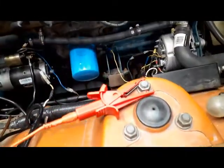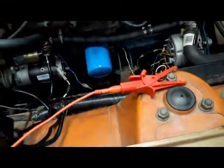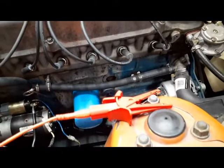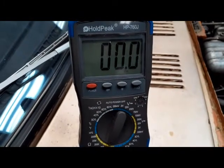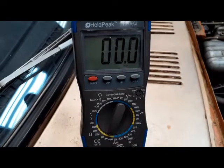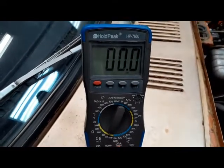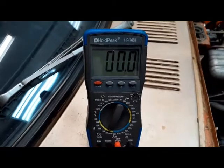What I'm going to do is get more on the meat of the clamp so you can see it's firmly clamped against the surface, and our reading has gone back to fluctuating between 0.1 ohms and zero ohms. So you can see mechanical contact with your testing surfaces is very important for resistance readings.